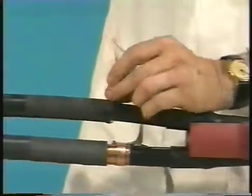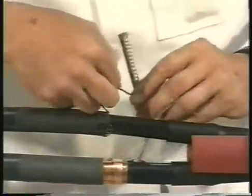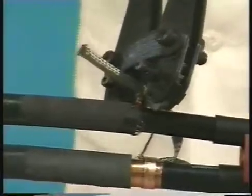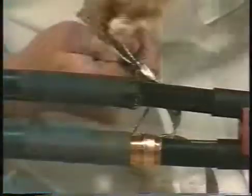To complete the tap side ground where the tap cable is wire shield, simply twist the drain wires to form a pigtail and connect the pigtail to the shorter length of the ground braid using a compression connector. Make sure you trim the excess braid and drain wires. Consult the installation instructions for completing the ground on the tap side with lead sheath or metallic tape taps.